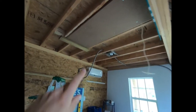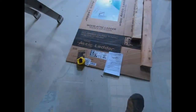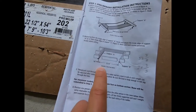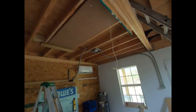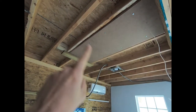Just be mindful of that. If you think you're going to need two people, then do that. The measurement of these supports has to be spot on. The instructions will give you the distance you need from support A and support B and tell you exactly how to do it. One thing you've got to make sure of is your opening is perfectly square or as square as humanly possible. Do your diagonal measurements to make sure it's square, because a lot of times when we cut it's not going to be perfect — but once you go to do your framing, that's your opportunity to get it really square.